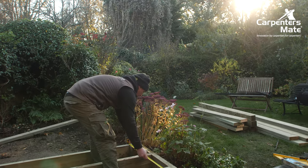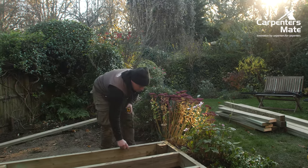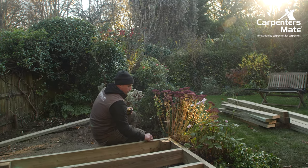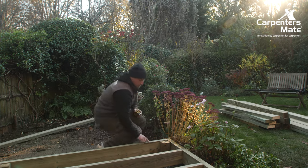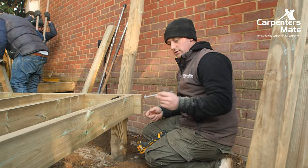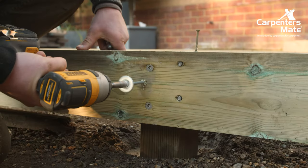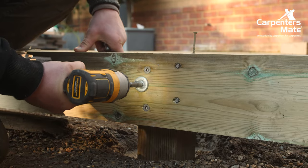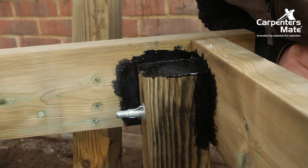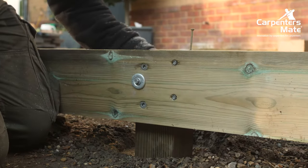This section is 3.6m, so we're going to put another joist on the inside so where these boards end there's a full joist underneath, and then we can run our new pattern from the other direction where it changes. Before we swap direction on the frame, we're going to add some true lock bolts through the joist and I'll show you how they work — we screw these on hand-tight, and structurally that post won't go anywhere now.